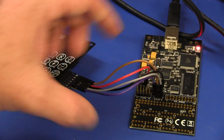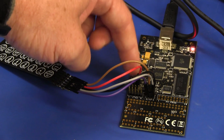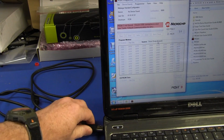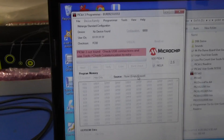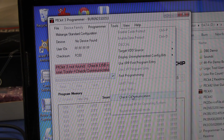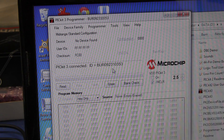It's got to get power from the actual board itself. It does that via a second VCC connector up here — if you're familiar with the AVR Dragon — it can supply power through to the board, no worries. So I've just got it hooked up to the ISP. We've got the new official firmware in there. We plug it in and it doesn't auto-detect. What I've got here is the PICkit 3 programmer software, but it'll work inside MPLAB X or whatever software you want to use. Let's go into Tools — check communication — and it should identify it as a genuine PICkit 3. It shouldn't know the difference. Ta-da! PICkit 3 connected. ID. No worries.